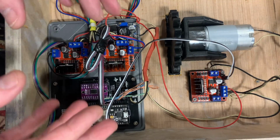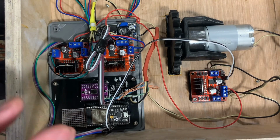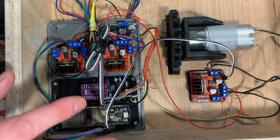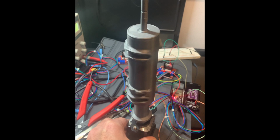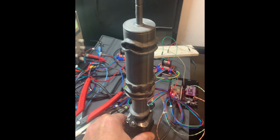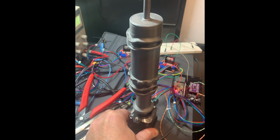And I think I forgot to mention this. Another cool part about the SimpleFOC library is that I can use a lot more voltage. Most of the stepper drivers today do allow you to go to 24 volts or so, but I was able to use up to 36 volts, or actually 30 volts through the L298N, which allows me to accelerate the stepper a little bit faster. And in the SimpleFOC library, I'm using what they call space vector control. This also allowed me to get some very dynamic response from the stepper motor itself. Again, it's not ideal. I'd like to come back at some point when there's not a chip shortage and build my own brushless motor drivers.